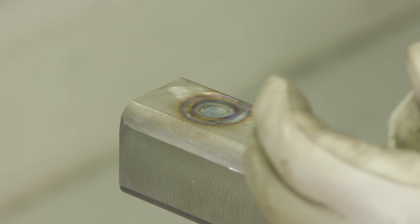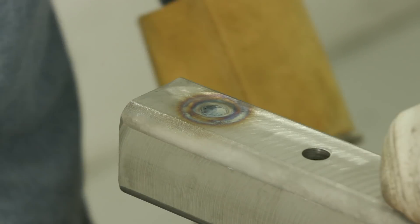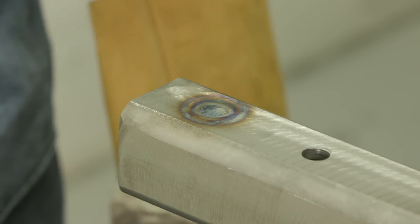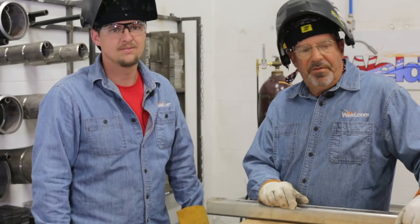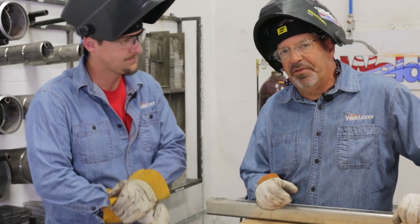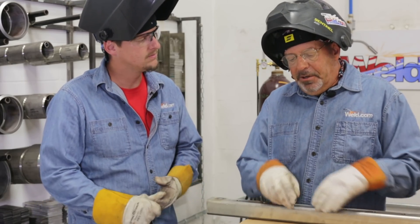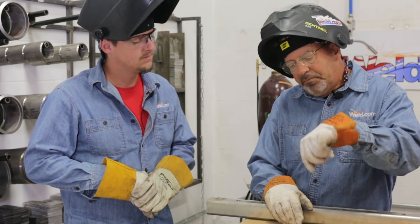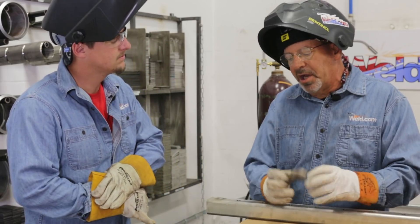We had the backer in there, put some filler wire down in there, and it did kind of melt and jump to one side, but at least it got us started. Once things melted together we were able to fill it in and push wire in there, bringing it up to the top so you can finish it off. Little trick there — hope you found that educational. There are a bunch of techniques for filling holes. I used to do a lot in beam work — somebody would burn an inch or lay out the bolt hole patterns wrong. I'd clamp a piece of brass on the back side, do a spray weld or hot flux core down in there, pop it off, dress it real quick, and go back and drill the holes correctly.